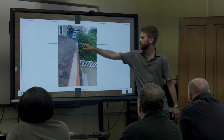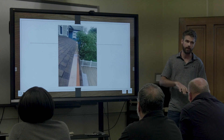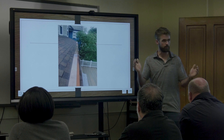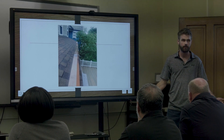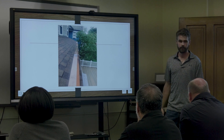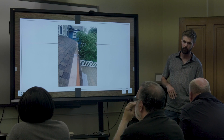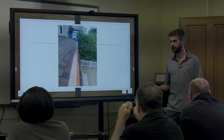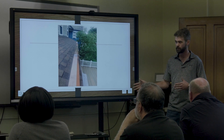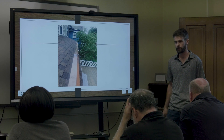Here's another expansion joint. It was broken up — you've got a cap on top, two separate gutters pitched to the left and right to meet the downspouts. Not every roof is going to need this. If you have a little 35-foot porch, you don't need it. Copper is going to expand a little more, so it's more important to have expansion joints if it's a 40-foot stretch. 16-ounce versus 20-ounce are factors — 20-ounce isn't going to move as much, while 16-ounce needs a little more support.